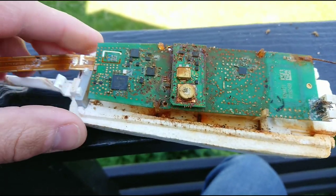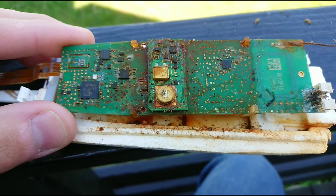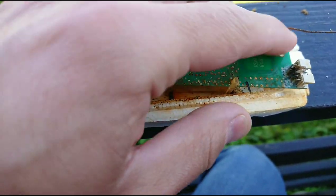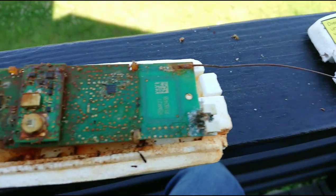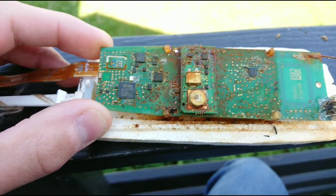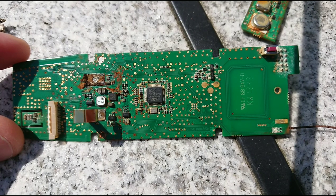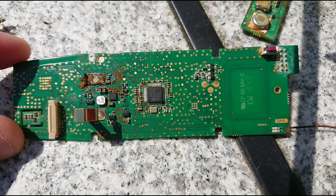On the back side we seem to have some microcontrollers and some other smaller logic controllers. Probably the GPS module has some PCB antenna parts, and the long wire could be an antenna or the wind speed measurements — I'm not quite sure which that is. I'll try to wash this up a bit. With the board all cleaned up we can see it is a nice gold plated and very ground-stitched board. I guess they probably had some noise issues since they have paid so much attention to noise cancellation here.